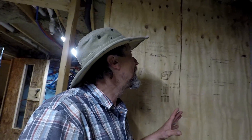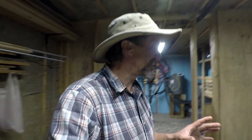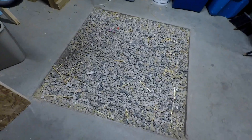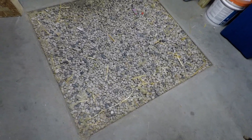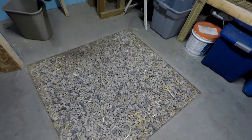It's late August up in northern Vermont, so we've got a lot of cold coming. Here we can control it as a resource — and there is humidity, but not too much and not too much humidity, so you've got to find the right balance. One of the features of the root cellar is this four by four foot hole in the concrete foundation. And then that's just stone — it goes down here for about five inches or more. So there's about five inches of stone in there and that'll allow humidity to come up into the root cellar.